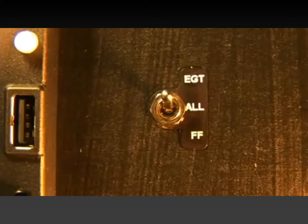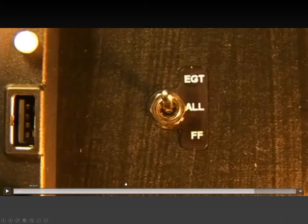But if you keep in mind that you need to do this at the start of your flight, you have this great additional fuel gauge that is arguably more accurate than the tank sensors, which just bounce all over the place, especially when it's turbulent. So it is a really helpful secondary fuel gauge, but it is not allowed to replace the primary fuel gauge, because if there's a leak and the fuel leaks out of the wing, the engine monitor doesn't see it. Also, if you forget to initialize it at the start of the flight, the indication will be wrong. So keep that in mind.